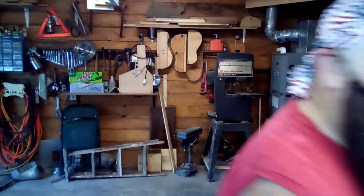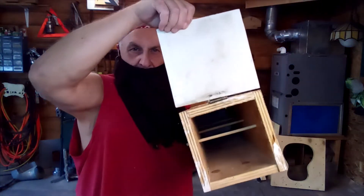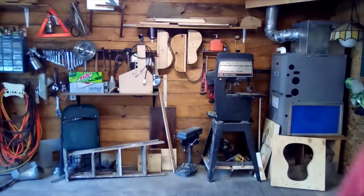Well, I was still getting a problem bending them like that because I was still bending them by hand, and I really didn't know what to do. So I came up with a steam box. I bought a steel gas can, drilled a hole in it, put a quick connect on it so I could put it on the stove, filled it with water, and put the steam into the box to soften the sides up for bending. But I was still bending by hand.